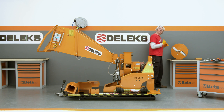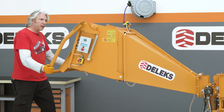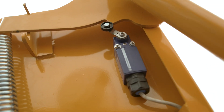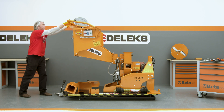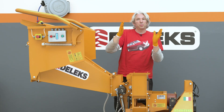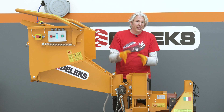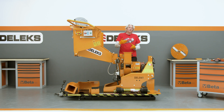With all these blades spinning around, safety is important and there are a number of safety features on this machine. The first is this bar — during running, if you push on it, it operates a microswitch which turns off the machine. If you want to store it, popping the bar up stops anything going into the machine, making it inherently safe. You can also hinge it up to a vertical position, which operates another switch that stops the machine from working — a further safety measure.